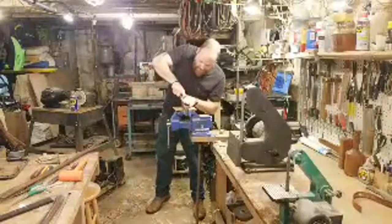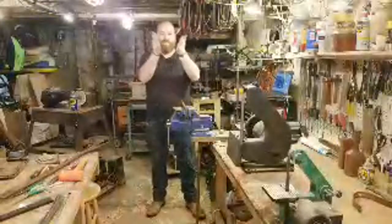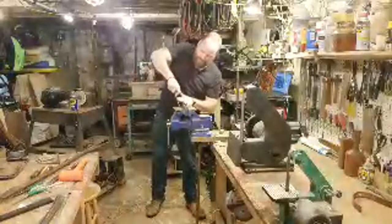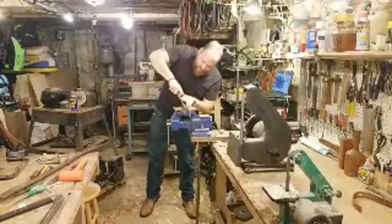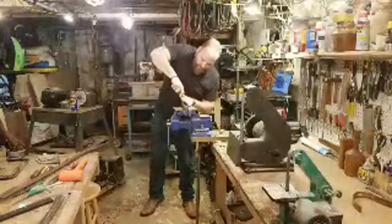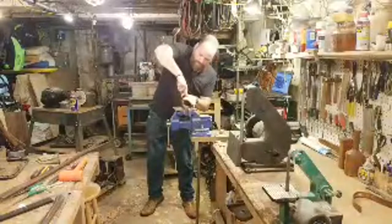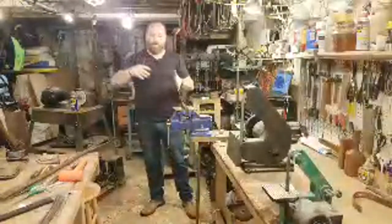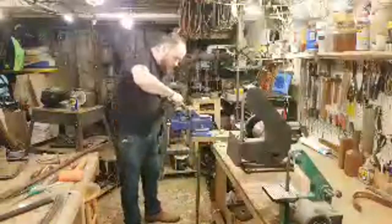Now I'm being extra particular about chamfering the ends of these lugs really well, because when you're hanging an axe head that has lugs, you have to worry about the axe head material coming down deeper onto the handle, and it can be tricky to get those to fit really well, as opposed to an axe head with a straight bottom, which fits all evenly. A lot of people want to cut out material for those cheeks. It's not necessarily the best thing to do. You want to taper the whole top of the axe handle that's going to go up through the eye evenly, and those cheeks will fit down nice and even, and everything else should fit well. So I'll show you guys that process too.